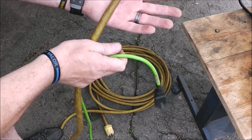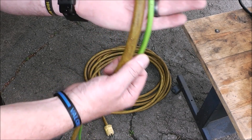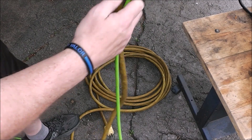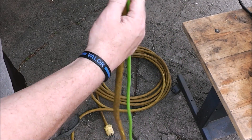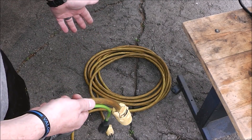You may sometimes run into an issue where you're working out in your driveway or garage or at a buddy's house, and you can't quite reach the plug-in from your welder, so you'll have to run a cord. Running an extension cord is going to reduce the number of amps your welder gets. You're going to want to run the heaviest extension cord you can get — not a little flimsy cheap one. Preferably number 12 wire or larger. This 12-gauge cord has real heavy insulation on it, compared to a typical flimsy 16-gauge cord, and you don't want a real long run — this one here is probably 20 feet tops.